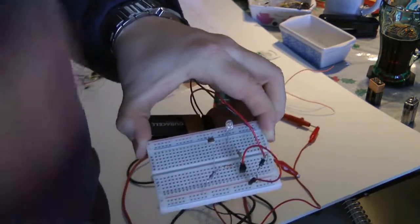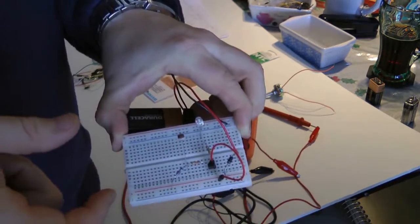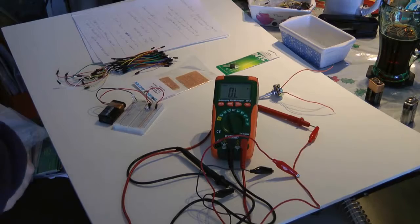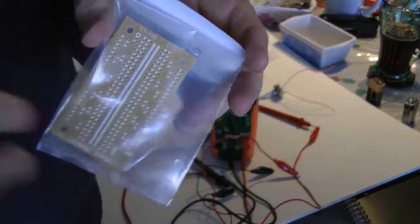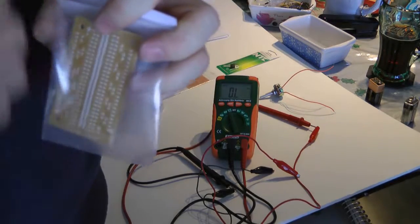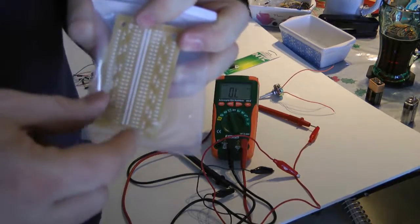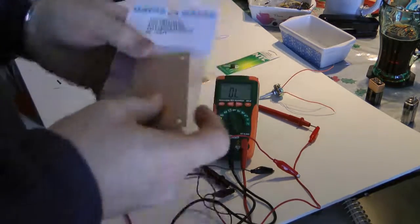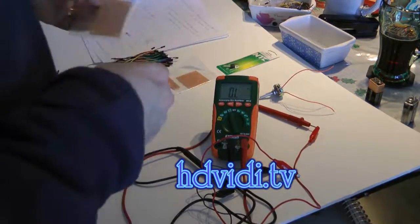But after that, in the next tutorial, we're actually going to build our own microcontroller, and it's going to cost us less than $10. We're going to build our own Arduino, where you can take the chips on a breadboard, program them, and then put them into one of these and use it. I think Adafruit has the chips with their own bootloader on them for like $6 a piece. So you're paying $6 and then a couple bucks for components, and then you're just putting that directly in here instead of using an Arduino development board. Or you could use the Arduino development board, take the chip out and put it in here. You still need the extra components. So we're going to go through all the pins, the microcontroller and all that other stuff.